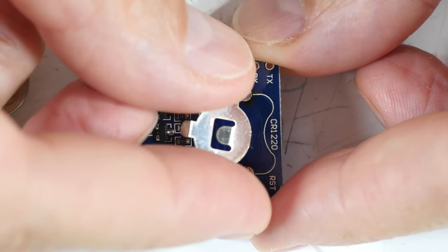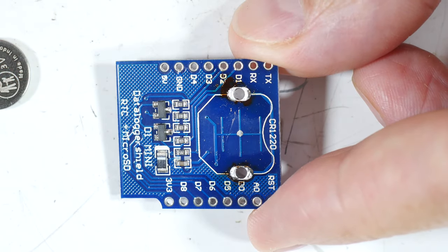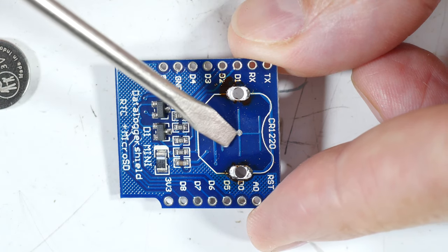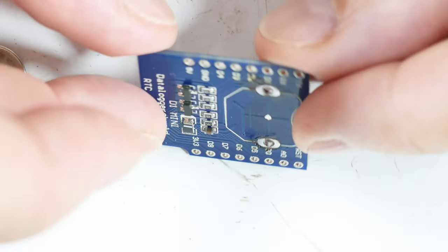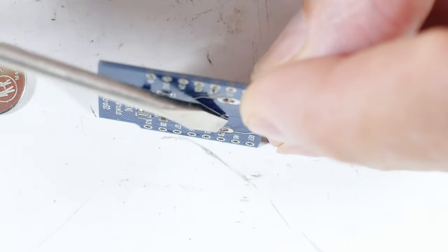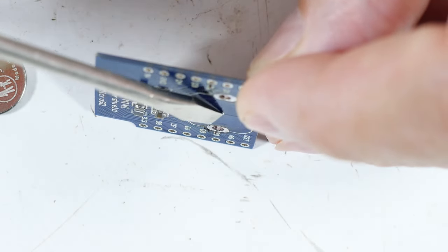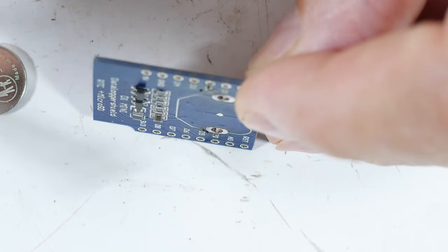As you can see, the clip is removed, and right there — that is supposed to be the contact on the bottom. You'll notice that it's almost flush with the surface of the board. That means unless the battery is kind of arced down, it won't touch that pad.